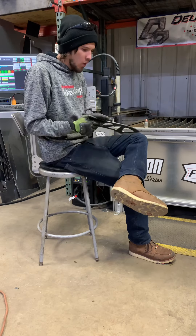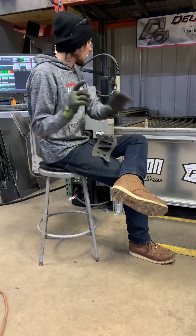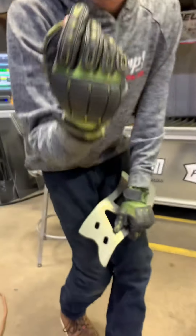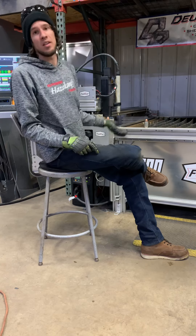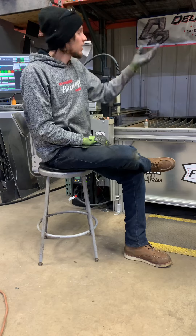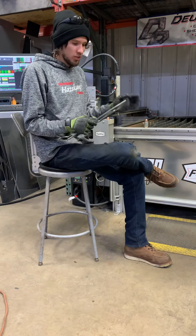I wasn't really looking for cut quality or speed — what I was looking for, and what I got, is there were not a single 030 air error, not one across the whole board. For people that don't know, you get a little bit of blowback. You can see up in this nozzle there's aluminum blowback in there from cutting aluminum yesterday. It blew up in there and then my torch senses that, pulls itself up, and says 'hey, you've got a problem.' So when I want to be at the grinding bench, at my press brake, sweeping, or outside playing with my dog, I can't, because I'm always worried about the table having an error and stopping and having to restart it. I didn't have to do that at all — I made it through every set.